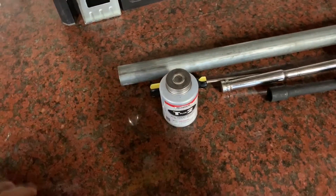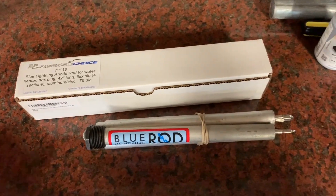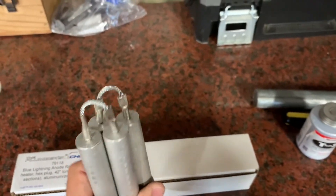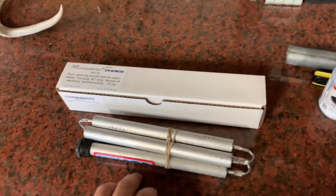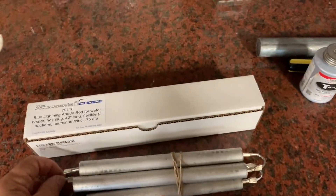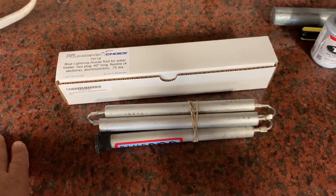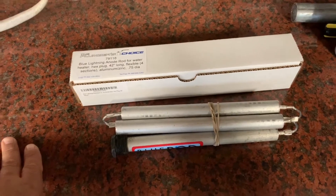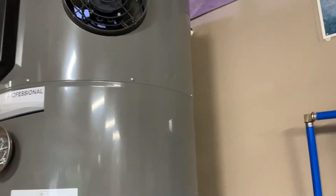You're replacing it with a sectional anode — I got this on Amazon for about $37. You can see the inch-and-a-quarter bolt on top, and this one is broken into sections connected by some stainless wire. This setup gives you the ability to feed the anode in through the top in sections, which is very handy for attic installations or where a closet ceiling is too tight. Also, if the old anode is going to hit the ceiling when you pull it out, you can cut it with a hacksaw, pull it out in pieces.